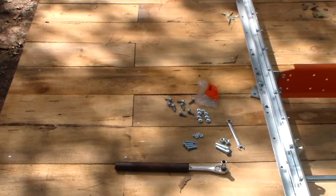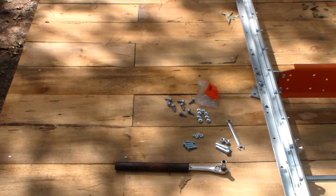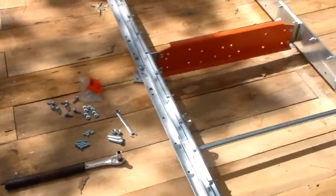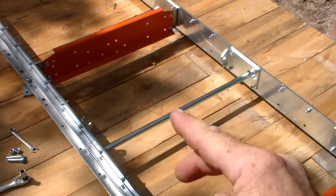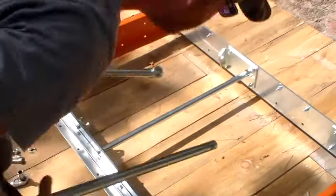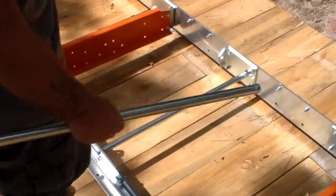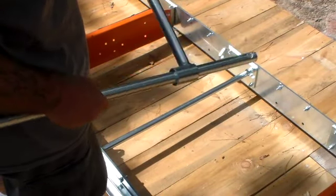With further examination, it looks like the nuts and bolts that I needed for the log rest are indeed included in the next packet of nuts and bolts, which I've got laid out. I've already used four of them installing the log dog rest right there, which are the two on the bottom for each bracket. Now we have to install the rest of it. So the next step is to slide the log dog bar into the log dog assembly, getting it positioned the right way.